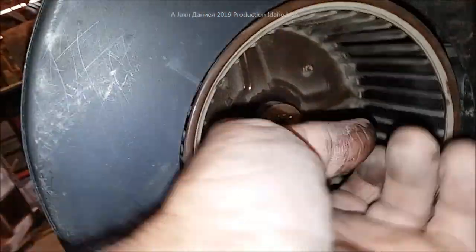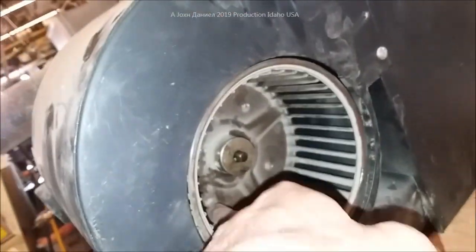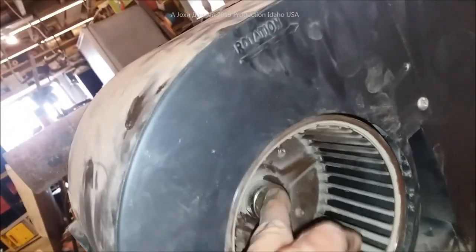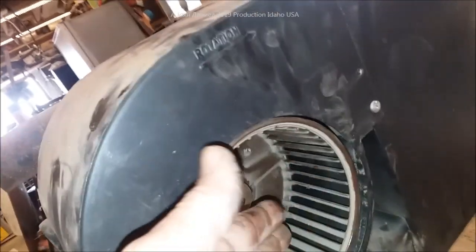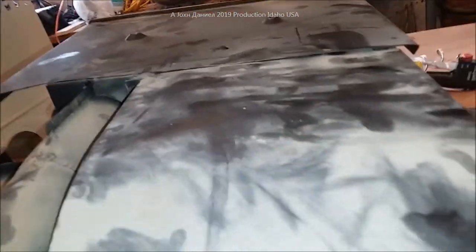This being an 18-year-old furnace, that's a good idea. I've taken this blower off — there is just a set screw right in there, which comes out with a 3/32" allen wrench. Do not take the screws loose anywhere else. Clean this really well with a wire brush, drop oil around it, let it sit for about 10 minutes, then walk it out. Make sure you align it correctly and don't over-torque your set screw. If it won't come off, oil it more or warm it with a hair dryer.